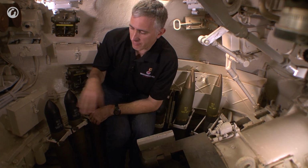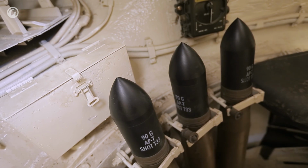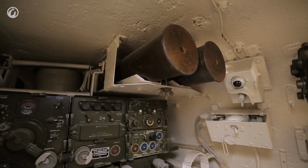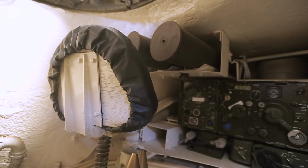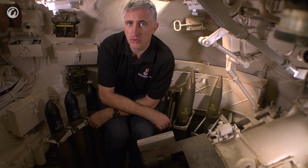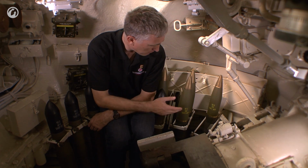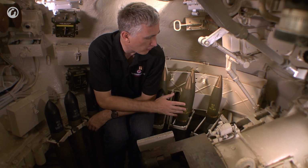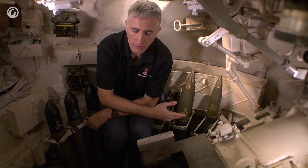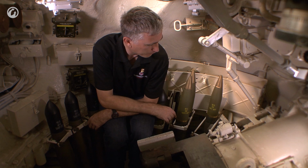Ammunition, he has 11 ready rounds in vertical stowage, 2 of which are just next to the commander. He also has the 4 semi-ready above the radio, and there's an additional round near him at the bottom right corner of the bustle. Of course, he probably will have an additional 12th round in the tube. Grand tally, 71 rounds stowed around the vehicle. So the others you can barely see perhaps through the hole in the basket. You can see rounds horizontally stowed in the hull sides. The platform beneath me is hinged and comes up out of the way.